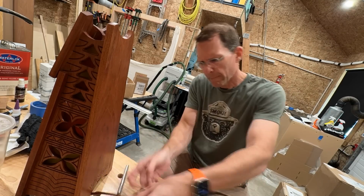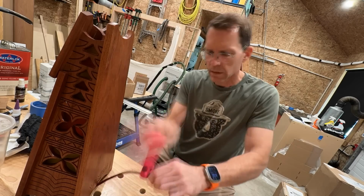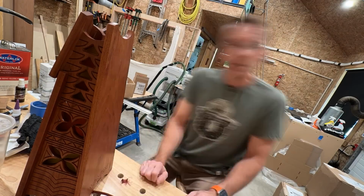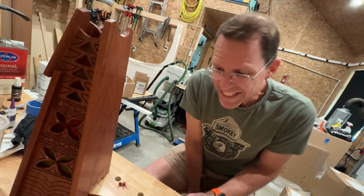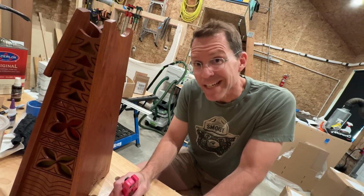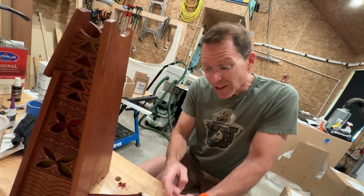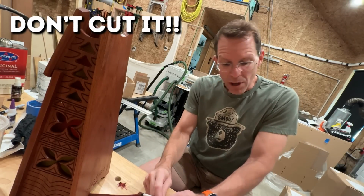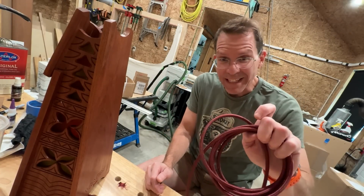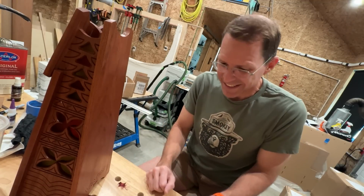So I'm in the home stretch on this project, and this is usually where I run into a big brick wall. And in this case, the brick wall is this braided wire. I thought this was going to take me all of 5 minutes to do, but this ended up taking hours. Okay, well, it appears that the fancy-dancy wire stripper tool that I used not only cut through the outside cord jacket like I wanted to, it actually cut all the way through to the wire. So we are going to have to cut this wire here, wire this into the light bulb, and then put the switch down there. Whoops. It's okay though, I have plenty of cord. We do not need like 12 feet of cord, so whoops. Oh, it's a learning process.